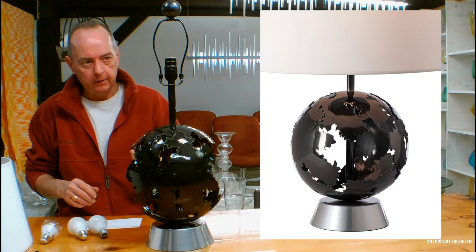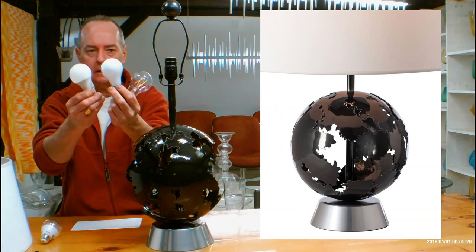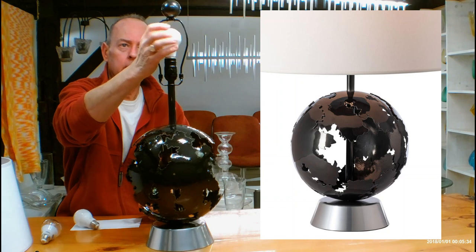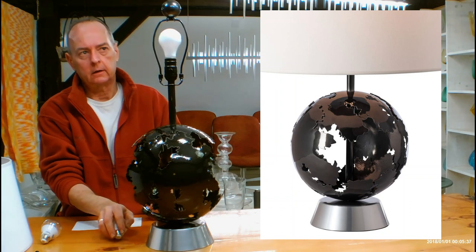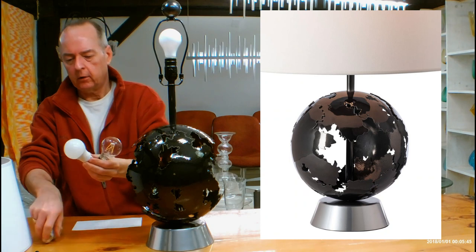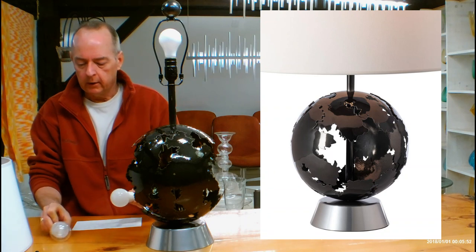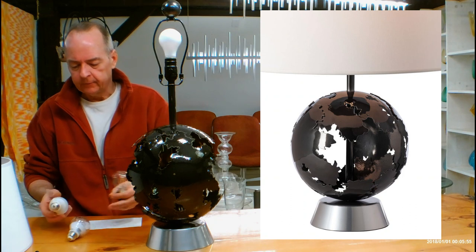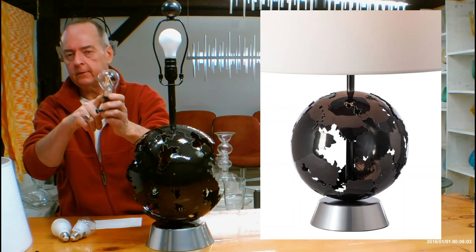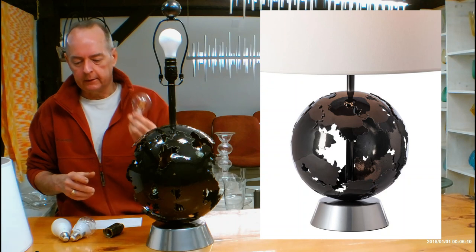As far as what you can put into it — for incandescent you can go 60 watts. These are all what are called A19, and A19 is the same size light bulb we all grew up with. When you get into LEDs — all three of these different kinds of LEDs I can find everywhere, my grocery store sells them, drugstore, hardware store, they're just everywhere — there's no limit other than the bulb fitting into this. I know I can find this bulb from Westinghouse at Walmart up to 150-watt equivalent, and also on Amazon the same way.